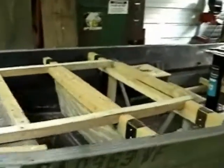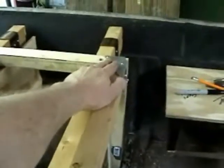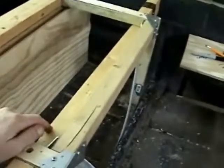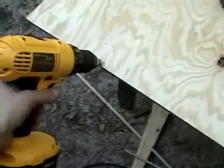She's all cut out. Before I forget — we got a couple of screws sticking up here and over here that are going to cause problems. I just took a carpenter's pencil, marked the top of the screws, put the plywood down where it fit, tapped it on top a couple of times, and it gave us little markings. Going to take the drill and nibble out those spots just a little bit for the screws.